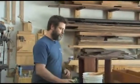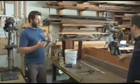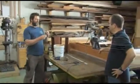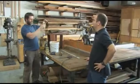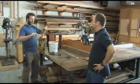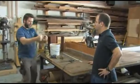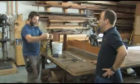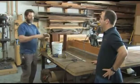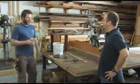Well, I was visiting my friend Keith in Fresno, who works in slabs, and he cuts a lot of veneers and stuff. And he had this weird framework that he'd gotten from Australia. It was like a vertical member with an A-frame sort of arm that swiveled on an arc, and you could attach a big router with a surfacing bit, and it would register and move along the arm. So you could swing it on the arc, and then move it 2 inches and swing it again, and thereby surface an entire slab. And it was made of aluminum. It was very high-tech and custom.